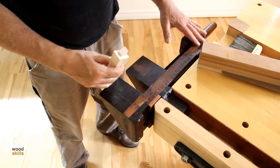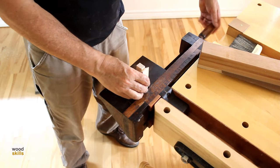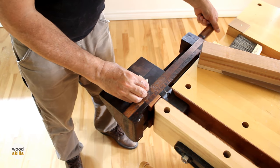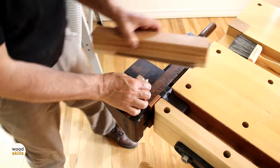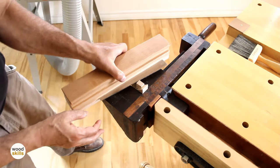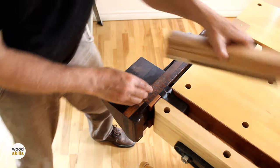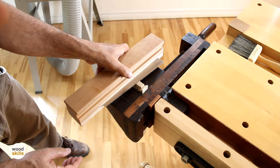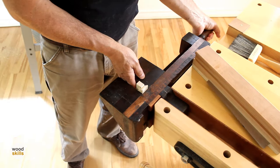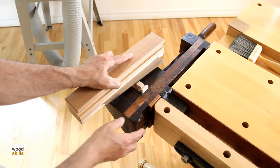So I've set up my second miter jack with its 90 degree face. You know what? Do it this way. I just do a preliminary installation and then set it up. I'll just work with a pencil mark in this case, because it does create an even end, so that's probably sufficient right there. And I'll just tighten that up, make sure that's tight, and just cut across.